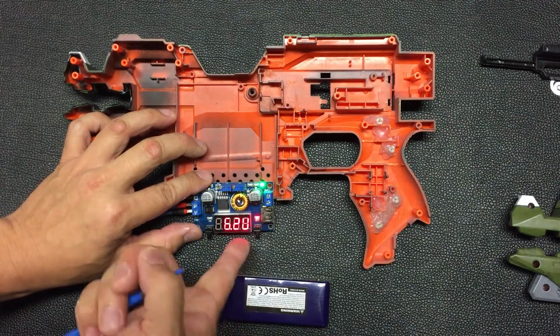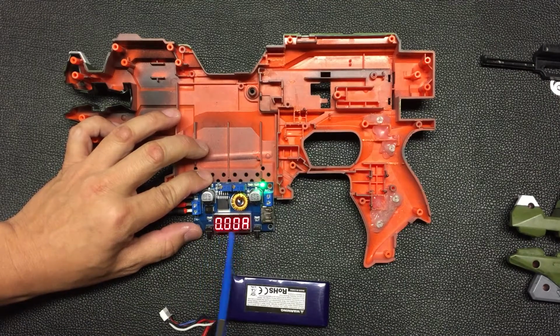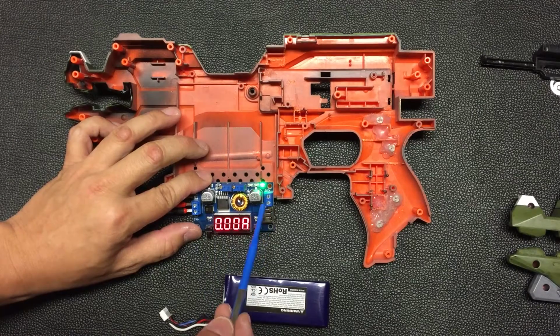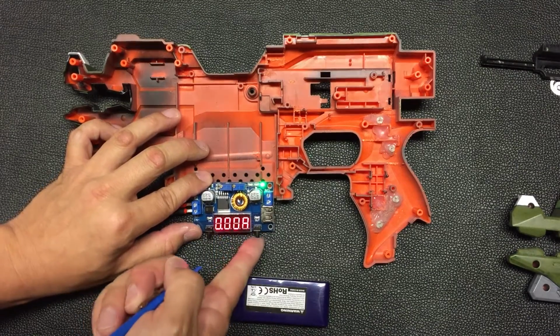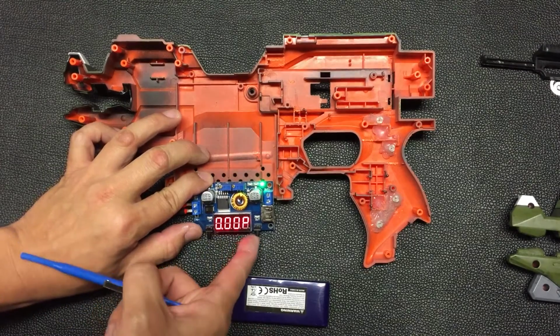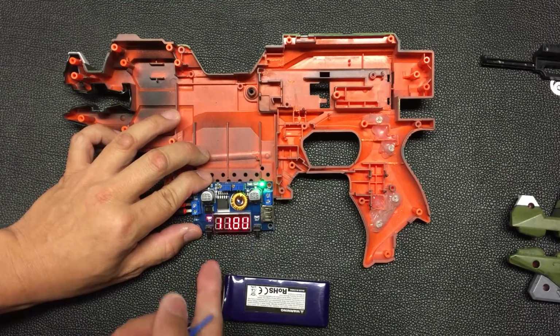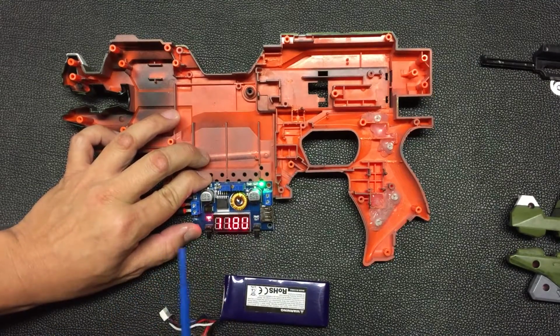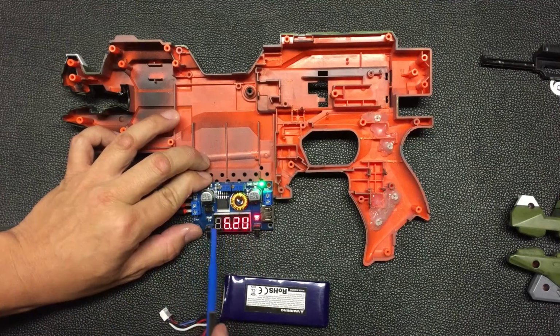If you press it again, you display the current that it is consuming. Here we did not connect it to anything, no motor is running, so of course the amount of current that it consumes is 0. If you press it again, it tells you the power. Press it again, you basically just look through all the various indicators. If you press it again, then it becomes the input voltage itself. So I use this as a voltmeter, and then press it again, this is the one that, when I adjust the ROF, I can take as the indicator, right?